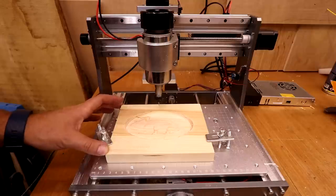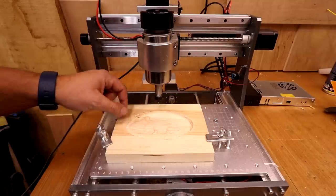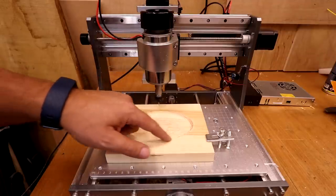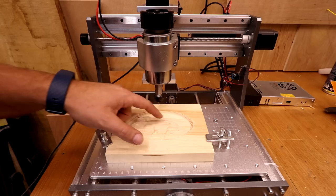The 3D relief cut took quite a few hours to complete, but the result is lovely. Considering how fine the tip is, it is so smooth — I haven't had to sand anything. Given it's pine, which can be fibrous, it's come out really nice. The detail in the fins on its back and underneath its mouth are sharp. There was a slight rough edge around the oval — not sure if that was the test file or the machine, so let me know how you get on if you try this cut. I also did a sound test during this piece and it was averaging around 68 decibels, maybe a fraction lower — pretty quiet; you can still hold a conversation while the machine is running.